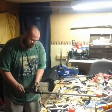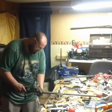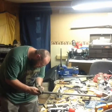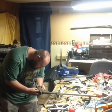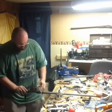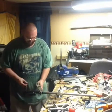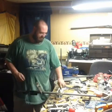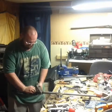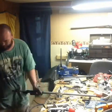Once you have it good and screwed on and started, like so, line everything up and just let the recoil lug ride with the receiver. Kind of hold it down against it and run it forward. Once you get it on there a little ways, take your go gauge and stick it in the chamber. Not on there far enough for the go gauge.